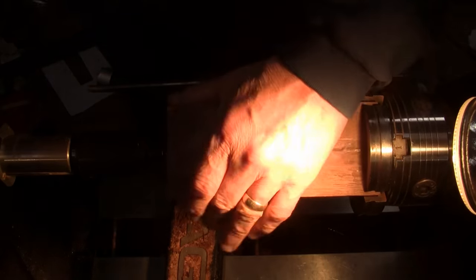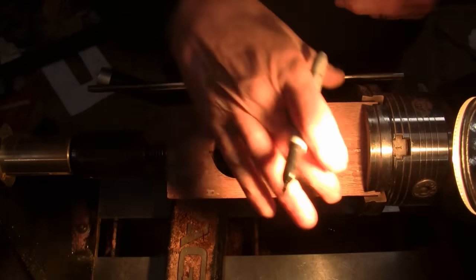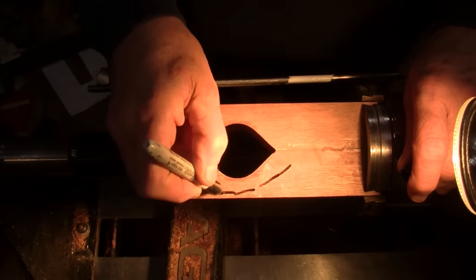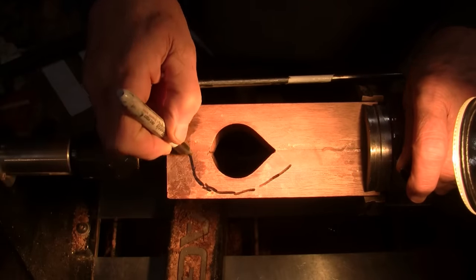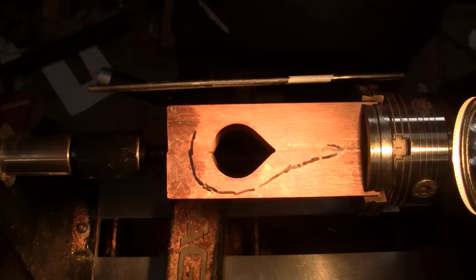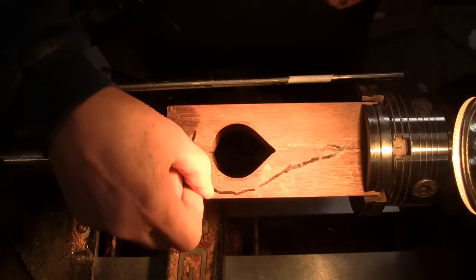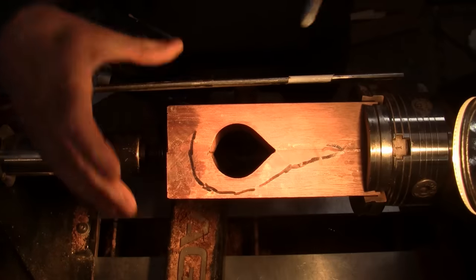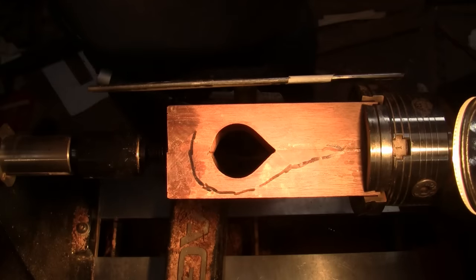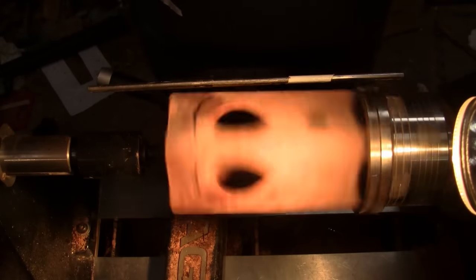The glue's been sitting quite a while — I think it's fine. It's back in the chuck with the tailstock against it. Let's just start roughing it out, get a wall around it, and taper this end off. Once I get this cut I'll have to figure out a way to hold it on the end — probably put a little cup center on there. I'll just start rounding it a little bit.